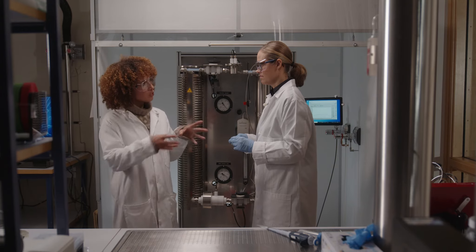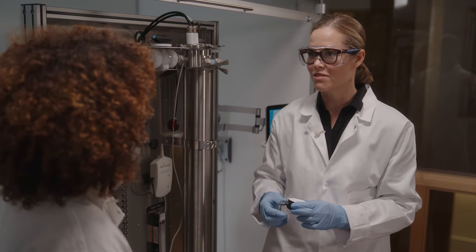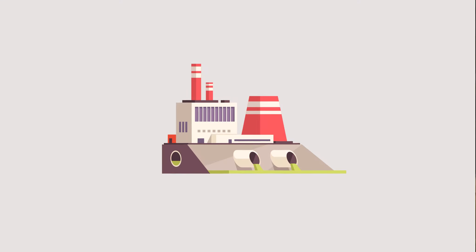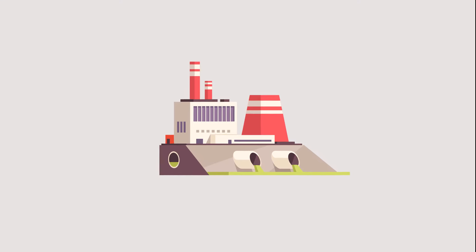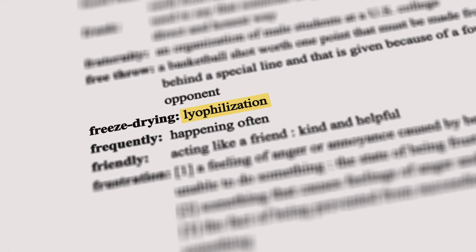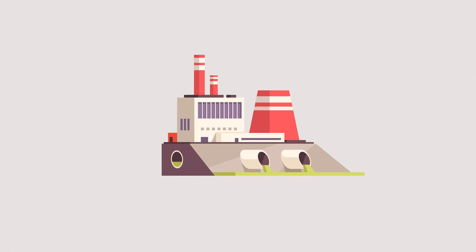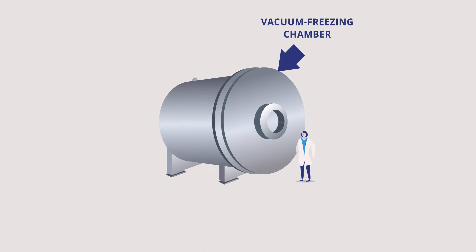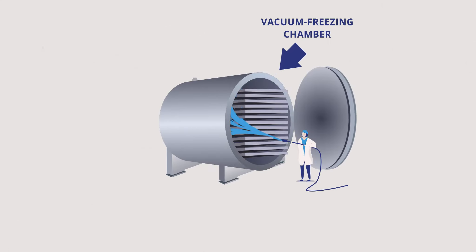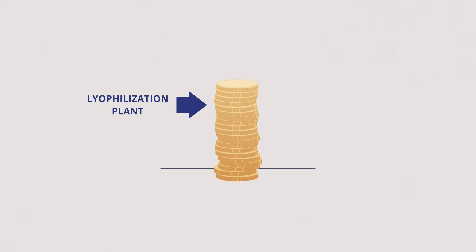Can we do this at volumes and not just with small amounts? Yes, of course, and this is exactly what we're working on right now. Today, the vast majority of vaccine packaging facilities, known as fill and finish plants, use freeze drying — also known as lyophilization — to dry their vaccines. It's a complex, capital-intensive process. Even small lyophilization plants require large teams and energy-intensive vacuum freezing chambers, each of which need to be washed between batches with cubic meters of water for injection, an industrial solvent that also has to be produced in the same plant. All of which adds up to major costs.